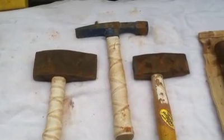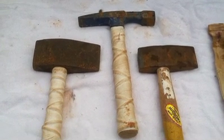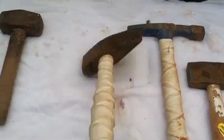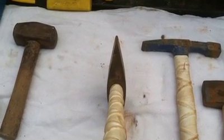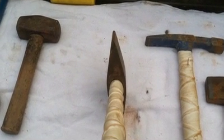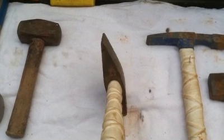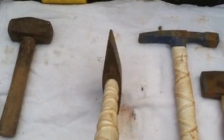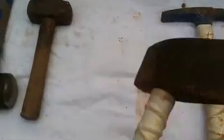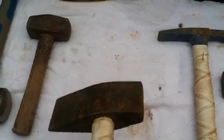These three hammers really represent probably the primary tools that I use. Here you've got a nice good stone axe. Although it's got a sharp edge on it, you might think that's intended for splitting big pieces of stone. It's really intended just to drive that thin edge into an existing fracture or schist in a stone and help it split on its own. The primary use of this is using the other end to bust off corners and sides of existing rock, just to shape them up a little bit if they need it.